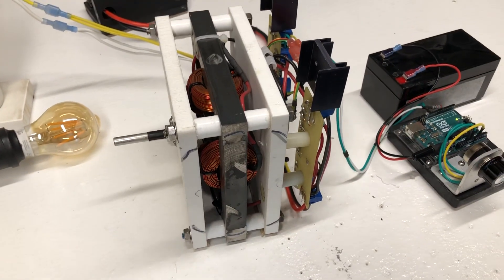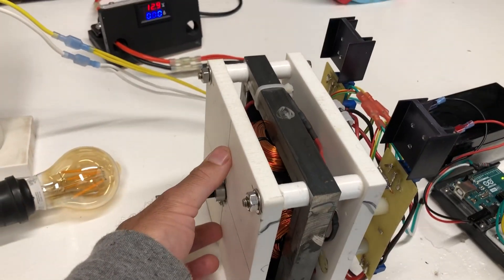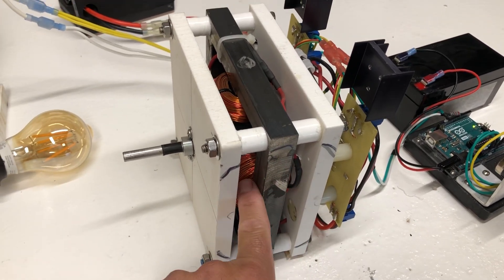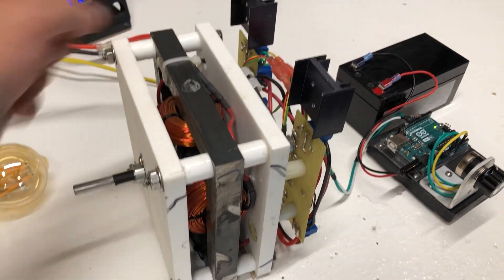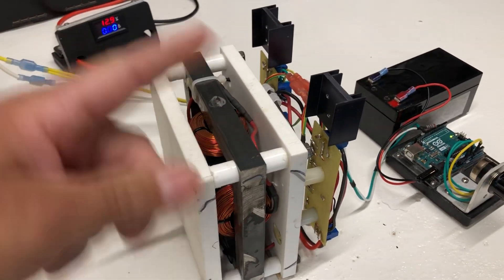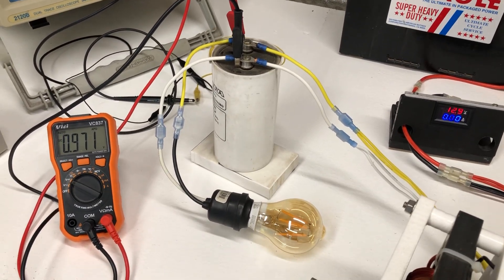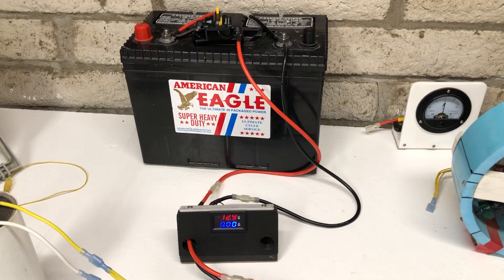So you have these two right here fired together. When these are firing in repulsion, the magnetic field goes around and has a place to go to here to make the attraction on the next pull even more. And then when it gets to this pull, these two fire with the second circuit, and it keeps going back and forth to create the rotation. The output today is going to go right up into this capacitor.